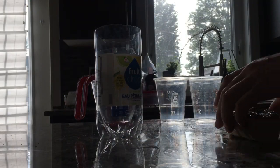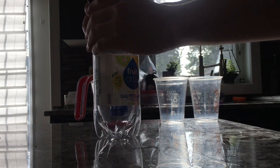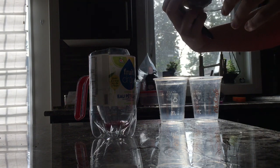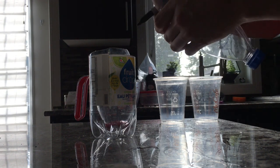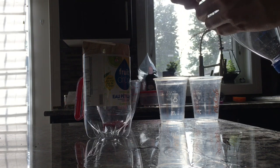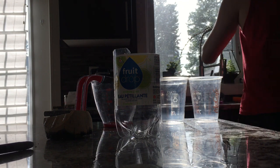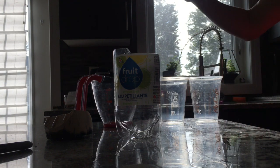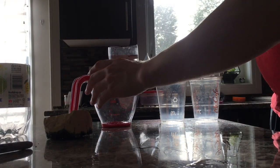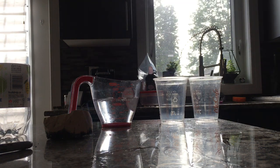Because I didn't know the exact volume, I figured it's easiest to just take the burl, estimate where it's going to sit inside the mold, and put a mark on there with a Sharpie. Since epoxy is close to the same density as water, I just go by the same amount of liquid. I filled it up with tap water to my line to figure out the milliliters rather than doing any math — it came out to about 300ml.